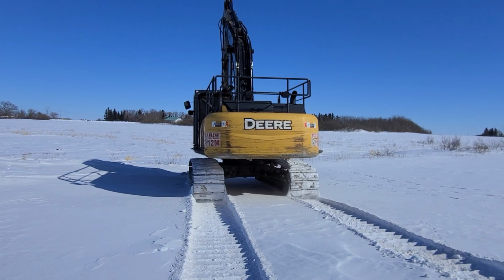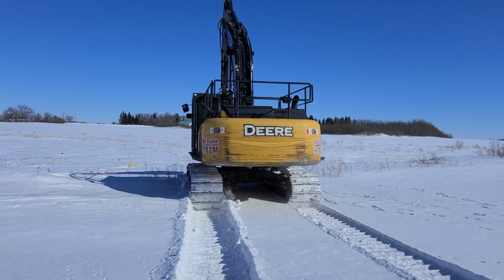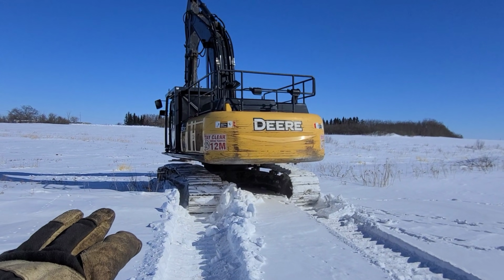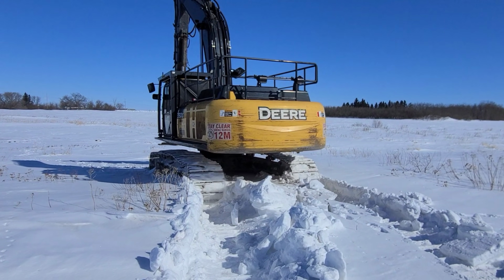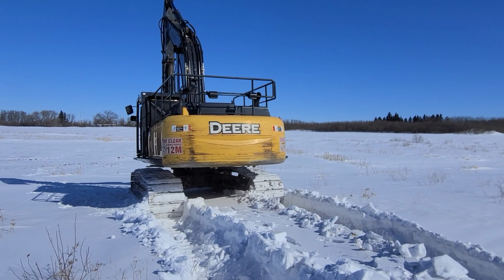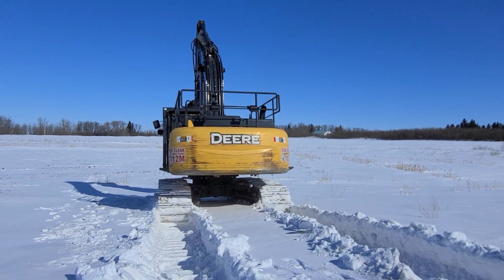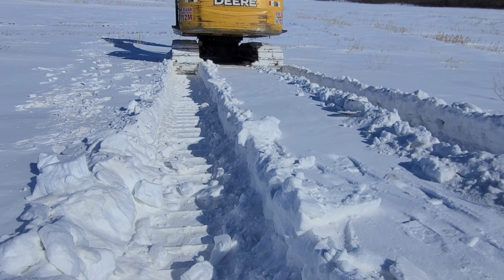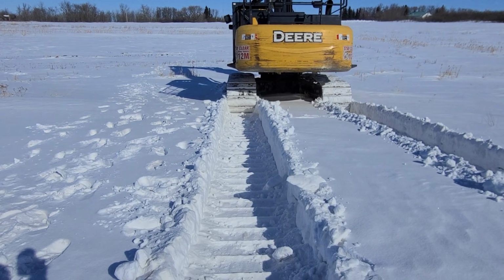So the question is going to be, how much frost is here? So frost can vary a lot. We do freeze. Our frost line is 8 feet up here. But if you drive on it, if there was no snow where it was bare, like even roads, you can push the frost down. It's not uncommon to have frost go down to 10 feet deep. So, for example, underneath this snowbank, it's probably not froze that deep. Maybe 3 feet. Because the snow acts as an insulation.